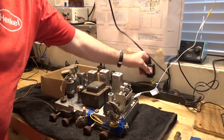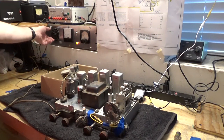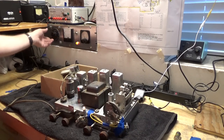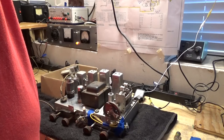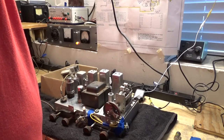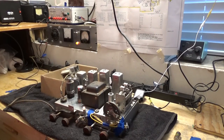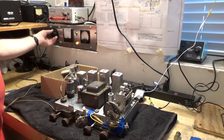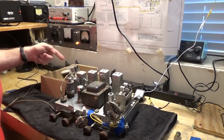We're just letting it soak in a bit. Let's unplug all the things that make noise. I'm okay with 45 volts, I don't see any problems with current — let's come on up to 60 volts. So far so good, guys. Let's see if we can get that speaker in there too. We've been sitting at 60 volts for a minute — let's go on up to 70 volts. Current still steady. Oh, check it out — I got some noise from the speaker already at 70 volts!